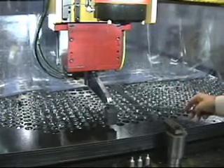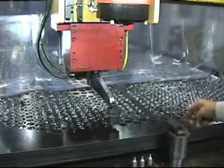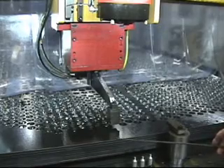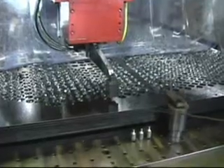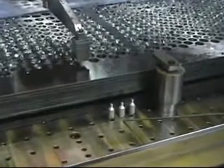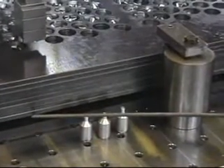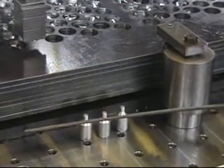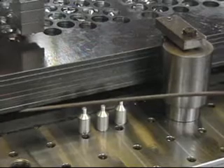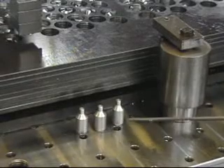The pressure foot exerts considerable force to the plates below. This stabilizes the drilling process in the case of a tube sheet, and clamps layers of plates firmly together when drilling holes in a stack of baffle plates. The next feature relates to part support. These pins I am pointing to are used for support under the product being drilled. The pins are applied into holes in a pin lining fixture mounted to the machine table. This patent-pending support system allows proper support under the condenser plates and baffle stacks when drilling holes.